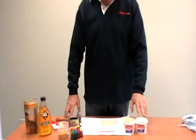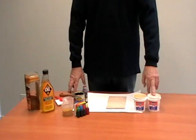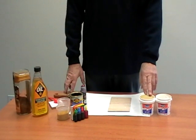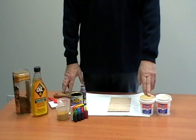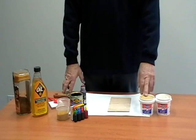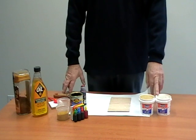I'll mention this again, but let me show you what I'm going to do. I have Timbermate in two colours: natural or tint base, and a colour called pine. Whatever I do to any of these colours by adding stains, I will change the colour as long as I'm staining up and not staining down. I can add any darker colour to a pine and get the same result as if I started with natural.